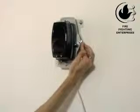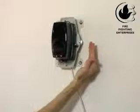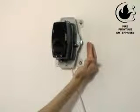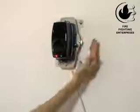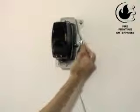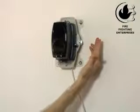Choose a thumb wheel. It doesn't matter which one you choose first. We are going to adjust both of them. Turn half a turn. If you get the amber LED, stop. You are going the wrong direction. Turn back a half turn and you get the red LED. Wait and let the red LED go out.